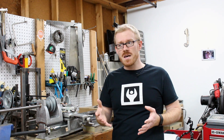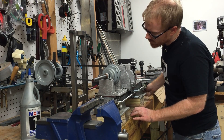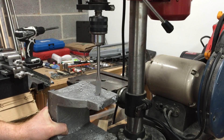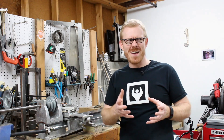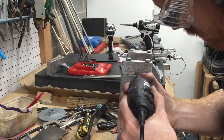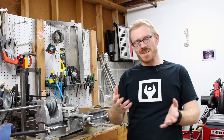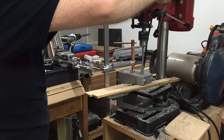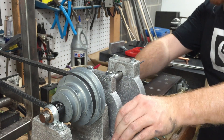I didn't follow the book exactly. The book calls for the pattern for the headstock to have a little semi-circular cylinder removed from the top part of the headstock. I didn't do that so I had to remove quite a bit of material. I used a 5/8 spade bit to drill through the headstock initially. It turns out that a 5/8 inch hole that isn't perfectly aligned with a 5/8 inch boring bar has some interference issues, so I ended up having to take a Dremel tool to it to enlarge that hole. Once I had clearance through the left side of the headstock I was able to drill a hole in the right side, then I took that over to the drill press and used a bigger spade bit to cut that hole. That worked out a lot better.